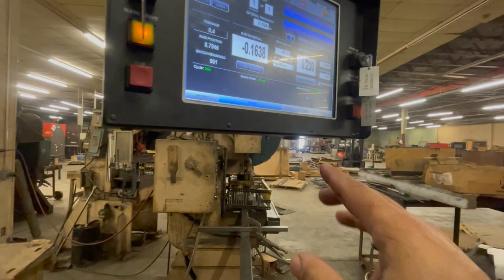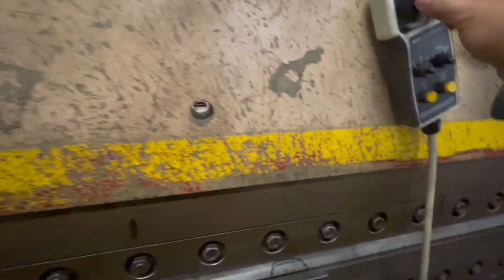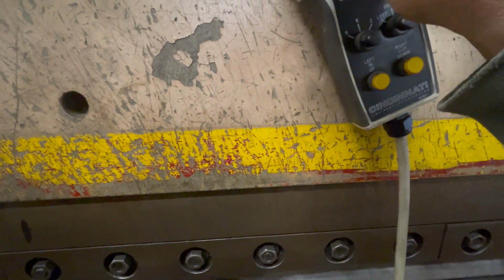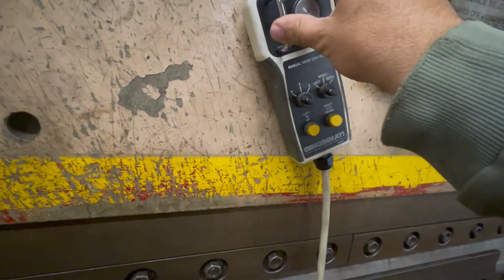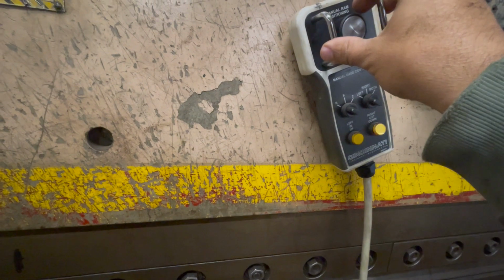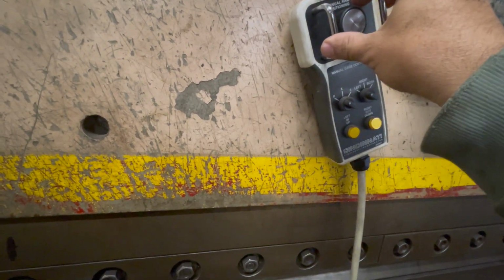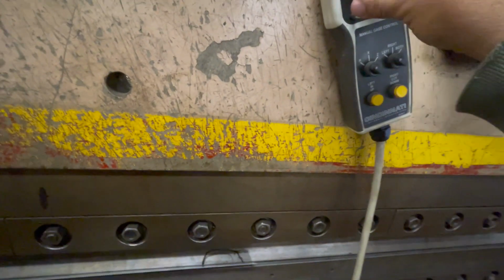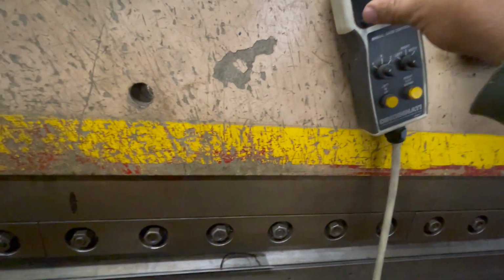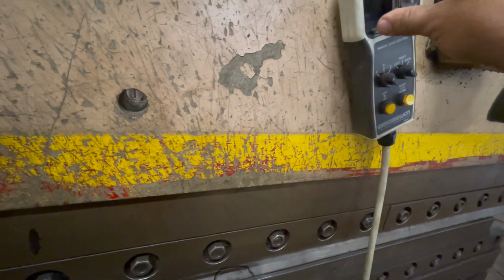But my point though is now I could bend 90 if I want, right? Dies in, I can bend 90 right now. I'm going to go ahead and bend 90. And you just go till it squeals a little? No. Or you max it out? This is 85 degrees, so not 90. Okay, so 90 would be a little open, really. Okay, I can leave it like this though, right? Anywhere there gives you a start point.